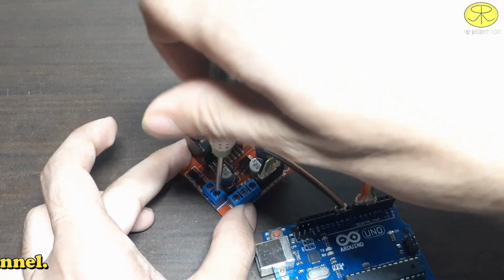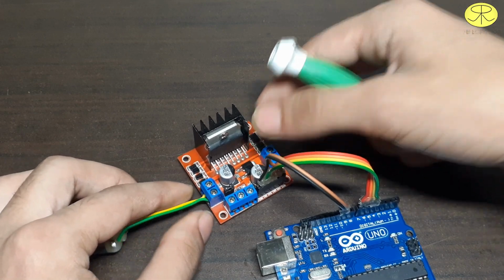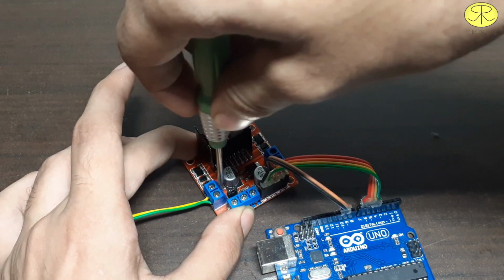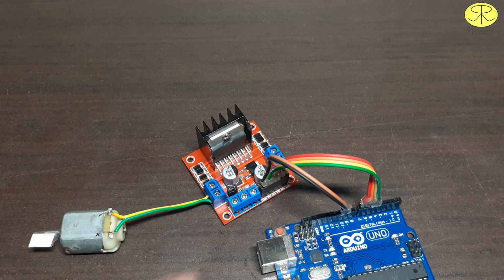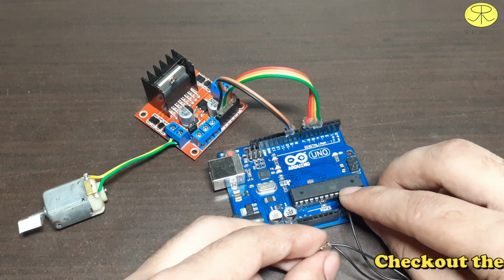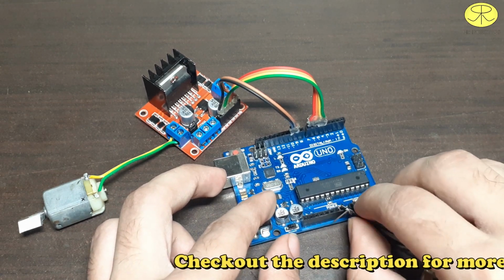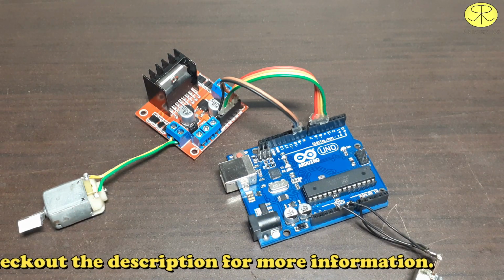Now I am connecting the 5V DC motor to the OUT 1 and OUT 2 pins as we have done in our previous video. Now connect the potentiometer as we have connected in the LED dimmer project. If you have not seen that video, the link is in the description below and in the I button as well.